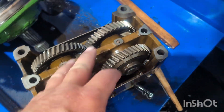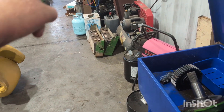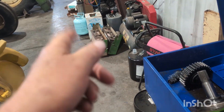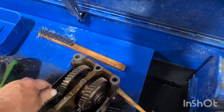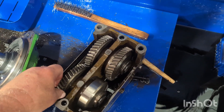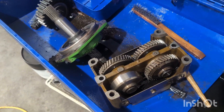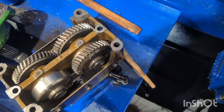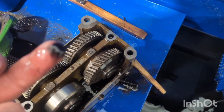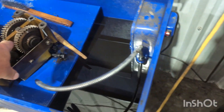That just helps balance. Your other four-cylinders like your 6400 John Deeres and some of them don't have a balancer box — they'll have balancer shafts that are like little camshafts that are timed and do the same thing. But this is simple and effective. I kind of like this one over the balancer shafts, though I have no explanation why. Let's get that guy finished washed and then mounted up and timed.